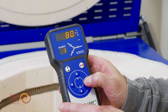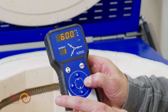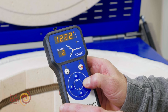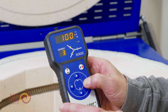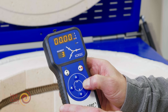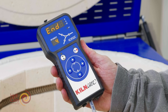If you now scroll through and check what you've done: it's going to be climbing at 80 degrees an hour to 600 degrees and then holding for 10 minutes in segment one. In segment two it's going to be climbing at 200 degrees an hour to 1222 and holding for 10 minutes. In segment three it's going to cool down — the arrow is highlighted — to a target temperature of 700, with no hold, and then free fall back down to ambient temperature.